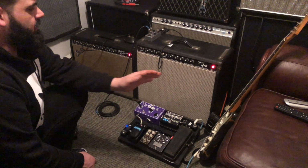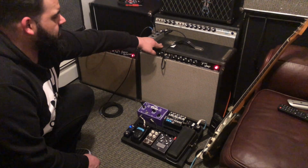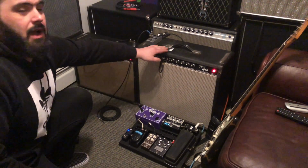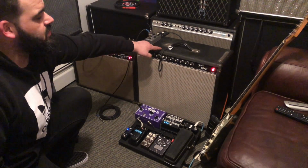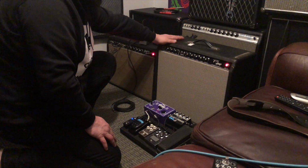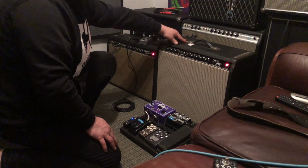So basically, this rig that I came upon consisted of these two smaller wattage Fender combos. This is my 1964 Fender Pro amp that was modified by Cesar Diaz, and this is a 1965 Fender Deluxe Reverb. I will say that Cesar also built in reverb into this amp, so it's essentially the same wattage and the same function and circuitry as a 64 Vibroverb. I will note that Cesar did beef up the output and power transformers in this amp, and he did add a reverb transformer, so this is essentially a Vibroverb circuit.